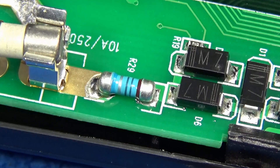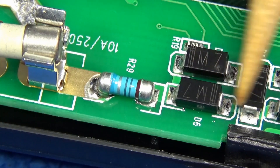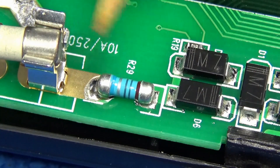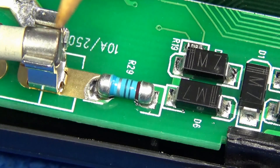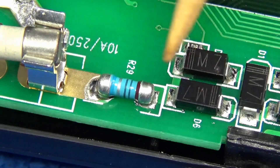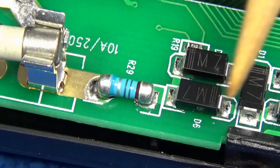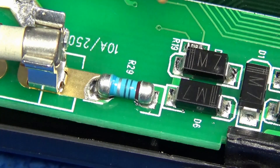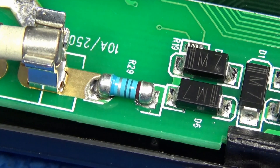If we apply voltage to the ampere scale, we are protected by the bridge rectifier at some level and the fuse at another. If we are not careful and apply 220 volts or 110 volts on the ampere scale, we will probably damage the equipment. Nothing will help, and it's not dependent on the multimeter — it's more dependent on us. The fuse is the first device to blow, and if there is enough time, it will save the tracks on the PCB from damage. So always be careful, because those kinds of issues depend more on us.